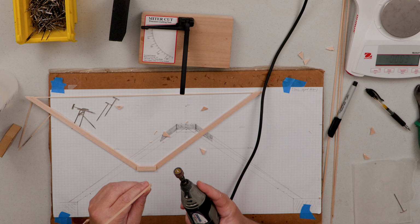To take the next steps, this bridge here held almost 50% too much weight, right? So for some of the primary components, we can significantly scale back the mass. Now, these tension parts are already 1/16 by 1/16 bass, and I don't have anything dimensionally smaller than that. But I have some components that are slightly lighter, so I think these are 0.63 grams. We're going to use that instead of the 0.77 here, just to give that a try.